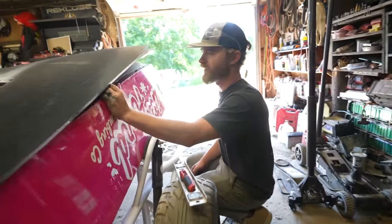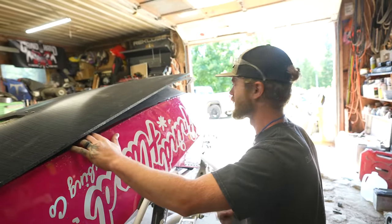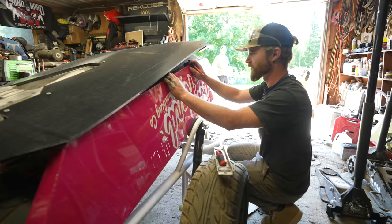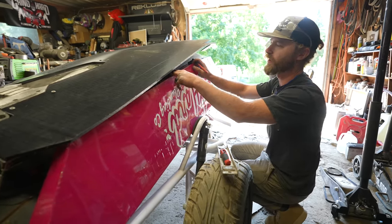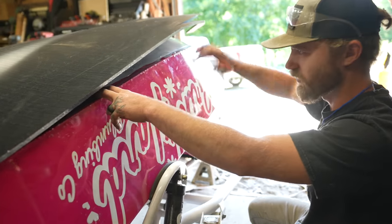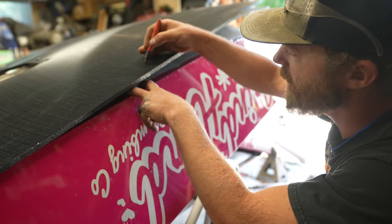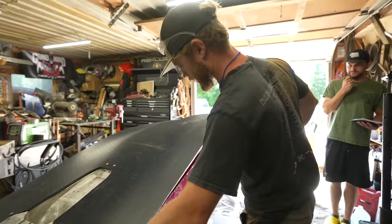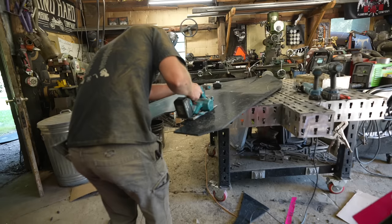I just realized that I can figure this out based on the welds on this, because everywhere that's possible when they made this hull, they would have made every bit out of a single piece without welds where possible. And right here, where my fingers are, is where this goes from being bent to welded because of the curvature of the hull. So if I go that same distance, roughly, somewhere in here, I could probably get away with a little bit more, something like that. I know that that section can be bent, and then from here forward, it has to be cut.